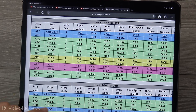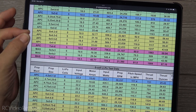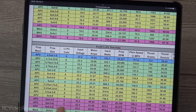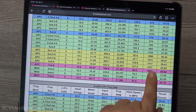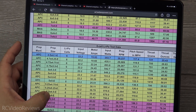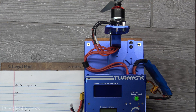We're at 33 amps on the five cell and 35 amps on the four cell. So what I'm seeing is an opportunity to trade speed for thrust — very clear in the use case for a five cell with a 6x5.5 and a six cell with a six-by-four: 1529 grams of thrust on a six-by-four at 35 amps, or 1100 grams of thrust at 31 amps with a 6x5.5. My plan is to test the six-by-four and the six-by-five-five props on 5S and 6S.